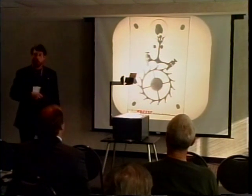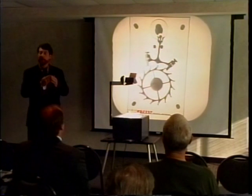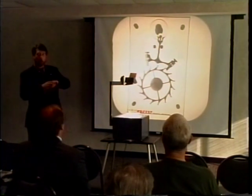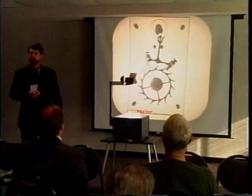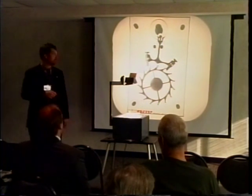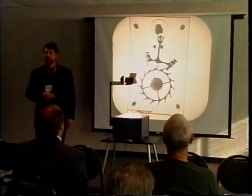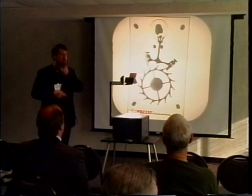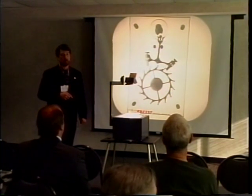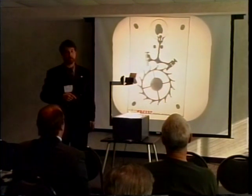52 degrees. So the moment the roller jewel contacts the fork slot to cause unlocking to take place, and the moment that it separates from the roller jewel to exit the fork slot to start the amplitude, or its disconnect from the escapement, draw your other line, and that's your angle of lift. I like to think of it as the amount of rotation the balance goes through, the degrees it goes through while it's engaged with the lever. Right. Yeah, that's a great definition.